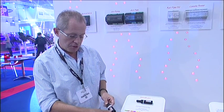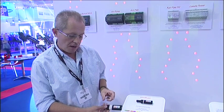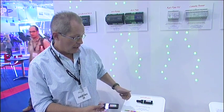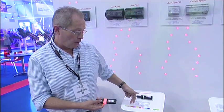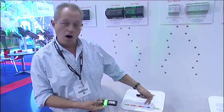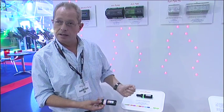In the other mode of operation you get a pulse train which starts with a long pulse of either green or red to show you good or bad, and then that's followed by ten potential different blips of colour which give you information about the signal. The warmer colours indicate error conditions and the colder colours indicate information such as non-zero start codes, RDM discovery going on, that kind of thing.